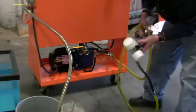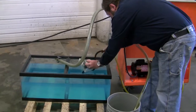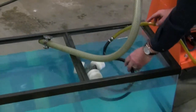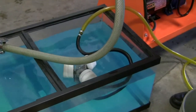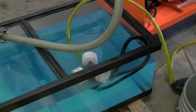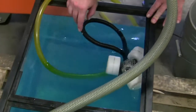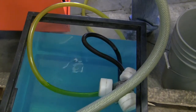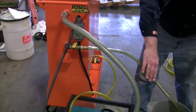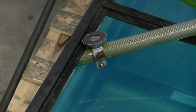Now I'm going to take the skimmer and put it in the tank. This black hose is very flexible and actually floats, which helps the skimmer maintain an even level. However, it's kind of porous, so you want to make sure the black hose is always in the liquid. Also, make sure the discharge hose is set up so that it's not submerged — it should always be above the liquid level in the sump.